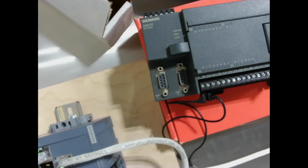All right, probably not too big of a surprise there. We do have the capability for, again, a wide range from somewhere between 9,600 bits per second to 12 megabits per second. So that's quite a jump up there. So remember, 9,600 would be 9.6 kilobits, so it's over 1,000 times faster. So you have a very large range window here for your speeds. We do have some interesting message sizes. So we can have up to 244 bytes of data per node per message. Bytes, that is. Remember, that's 8 times that.